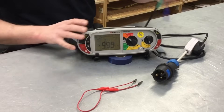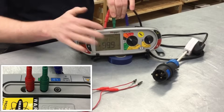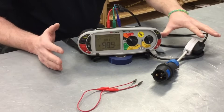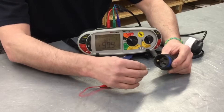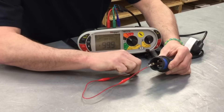We're going to be using the red and green sections on the end of our plug top lead, into the red and green sections in the top of the Megger MFT. I'm still set to the ohms scale and again we're going to remove the resistance of the lead, the modified 16 amp plug top and our link, by linking together the earth pin and the line pin.